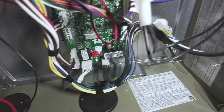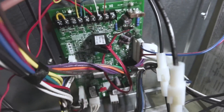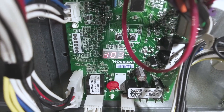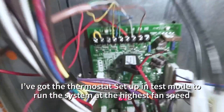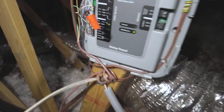Welcome back. This is just a quick video on how to properly set up a variable speed furnace — an XV system with an S9V style furnace, non-communicating. During this maintenance call, our airflow is only about 700 CFM total, and that's because it hasn't been set up properly. The BK terminal needs to be set up on the relay panel.